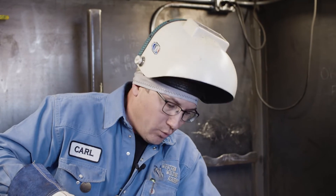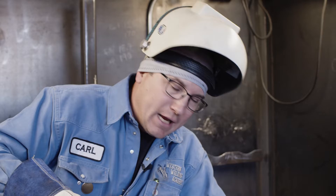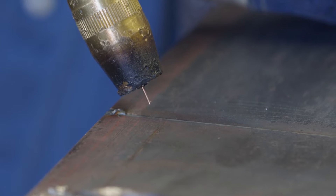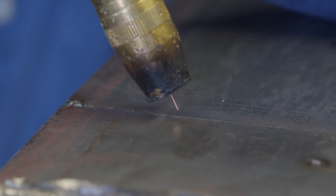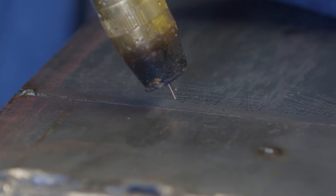Your travel speed when you're welding — when you're looking at your bead, you want it about three-sixteenths to a quarter inch wide in diameter. If you start traveling faster, your bead's going to get smaller. If you start traveling too slow, your bead's going to get wider. A good travel speed is going to give you about a three-sixteenths to a quarter inch wide bead. The first few times you try to run this bead it's probably not going to look the best, but if you practice and keep that bead about three-sixteenths to a quarter inch wide, that'll maintain your travel speed and it'll look good.